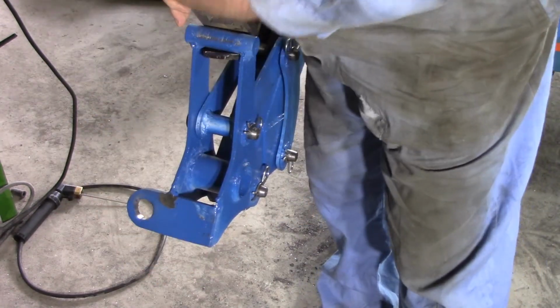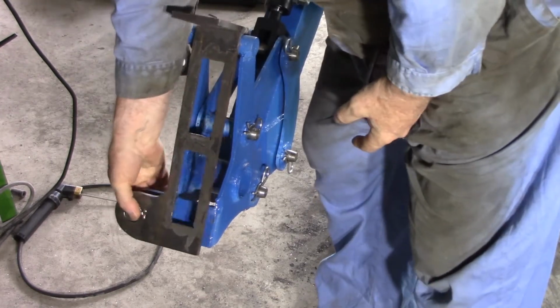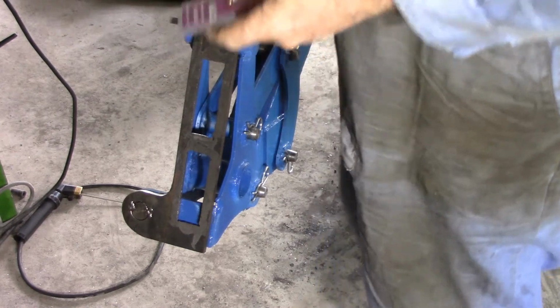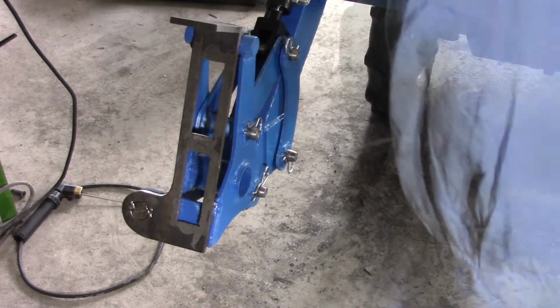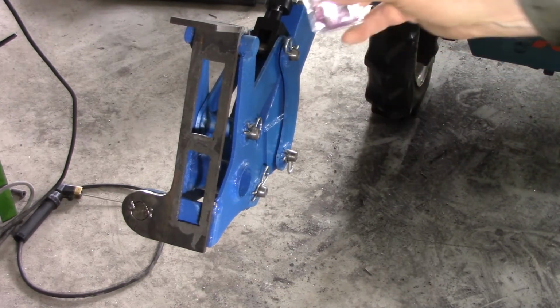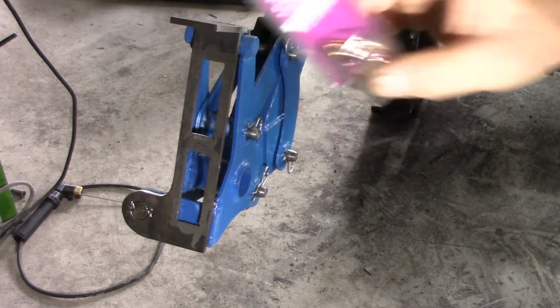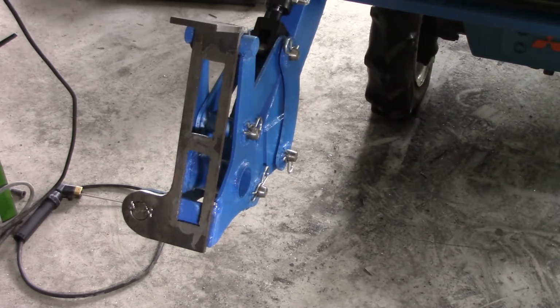Now we've got to drill some holes for these 5mm Lynch pins. They're going to go through this pin vertically from the top, of course, just to hold the bucket on there. Now I think the 5mm Lynch pins will be fine. I've used 5mm for holding the main ram pins in. So I'll just drill these holes next, get them right. Once these are right, then it'll be safe for me to go ahead and weld these pins in. I can grind that off and then see about welding the whole lot onto the bucket. And that will finish the bucket build.